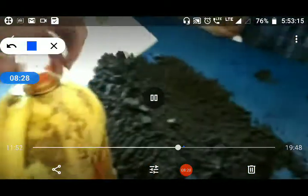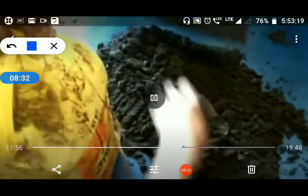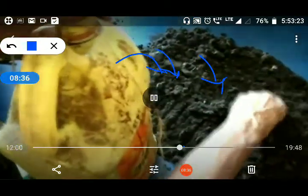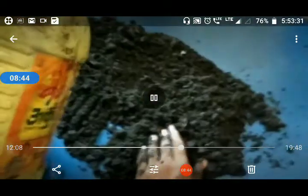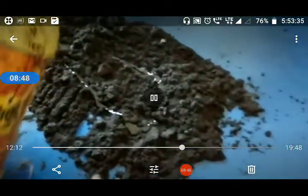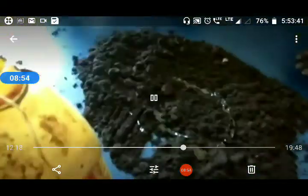This is the mixing of silica sand, clay, water, and molasses to prepare the casting sand. This is molasses — molasses is the by-product of alcohol. We have to add some molasses into the sand and mix it properly so that it can bind with the pattern as well as the flask. Molasses is the binder.